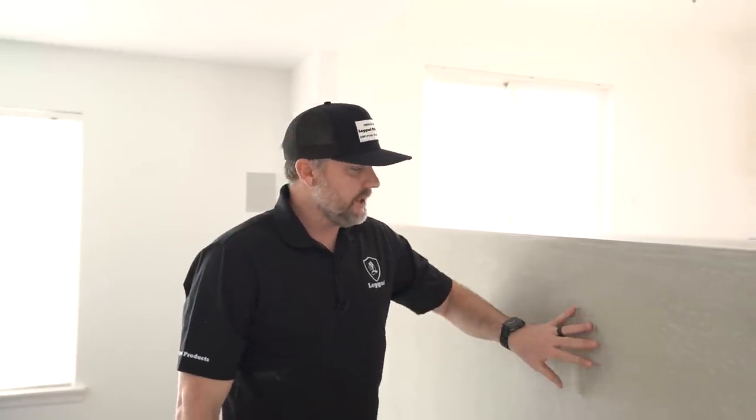Let it dry out and then seal. You never wanna apply the urethane top coat over a wet surface. So we'll let this dry out, and we'll show you guys the staining process next. And if you guys have chunky spots, thick spots, you can do like 80 grit, 120, sand those down and then finish them off with a 220 so you don't have big scratch marks in it from that rough sandpaper.